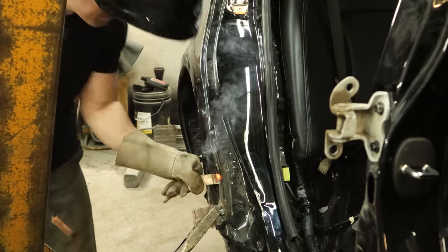We don't have to take those tabs off that we welded on — we just bent them out of the way a little bit. We'll start our bolts and run them in; it'll line itself back up. It still closes okay and the gaps are still good. There are a couple little dents here that the Bodywork Gnome can take care of. We're not going to worry about pulling that piece too close since we're going to cut it off anyway. Everything else is where it belongs, so I think we're going to call that good.